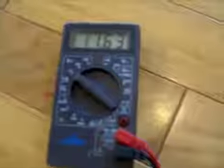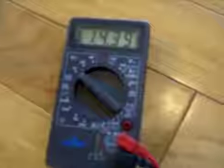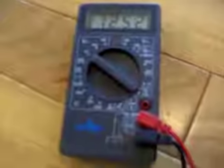So first what we're going to do is bring the bicycle up to speed. I've got it in top gear, and so we're generating the maximum amount of spin possible. You see right now that the battery still has about 11.5 volts on it. I'm about to flip the switch. Here we go. And you'll see now that we're generating 14.4, more or less, from the alternator. Now, what I didn't tell you is that once the process has started, I can turn the switch off. And so you'll see it goes back to 12.2, but we are still creating 14.4 volts out of the alternator.